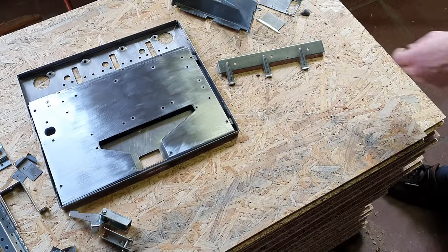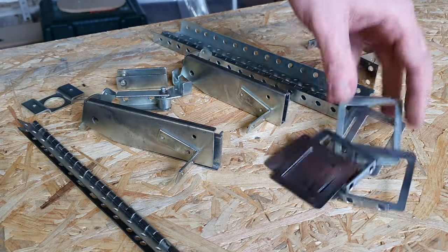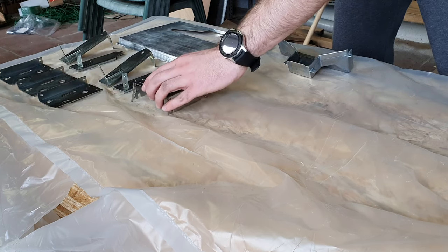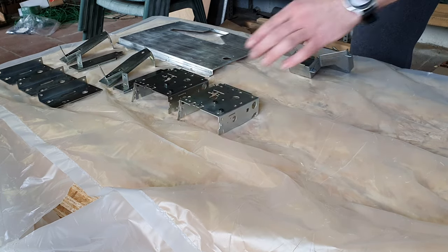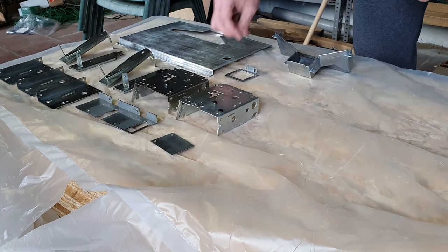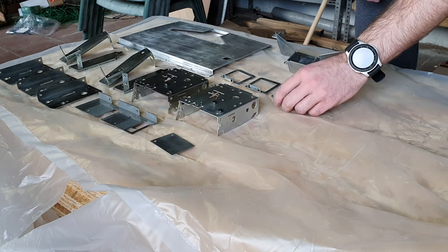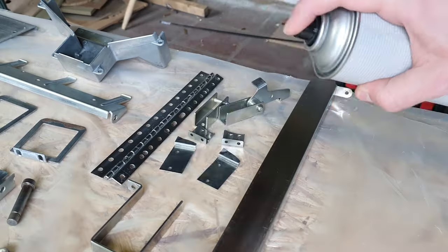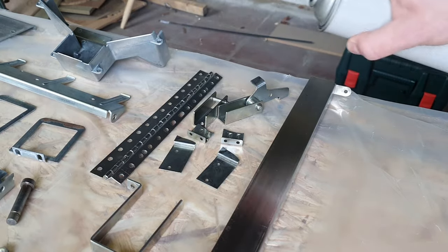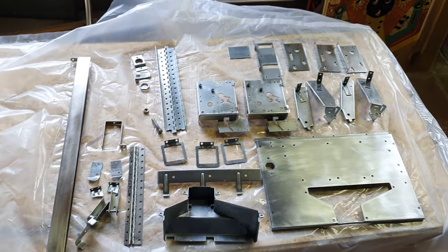I continue cleaning up each and every metal part of the entire door, from the big hinges and chutes down to the smallest brackets and bolts. Now that all the metal parts are nice and shiny, I'll put a coat of varnish over them. Some of these parts have some kind of plating which sanding might remove, so just to be sure, I want to give them some extra protection. I lay everything out on a plastic sheet and spray all the parts with clear varnish from different angles to get all the surfaces. Everything can now be left to dry.